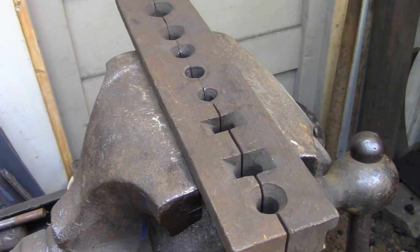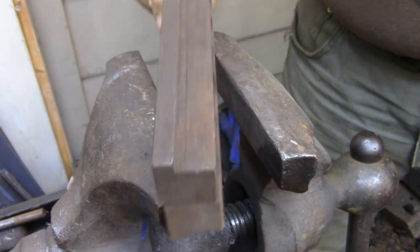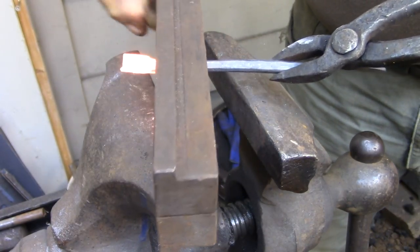This is an old bolt header that I've had for years. It's a shop-built piece - it wasn't commercially made. You can see the detail at the bottom right here that makes this different from a normal vise insert. That lip keeps the bolt header up above the jaws of the vise, so you can do a lot of hammering on this and it won't be going anywhere.